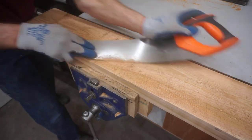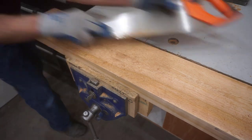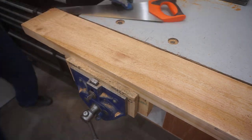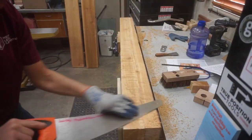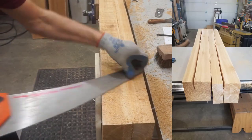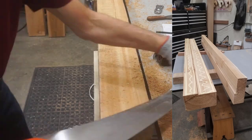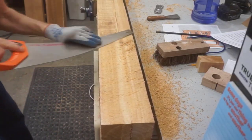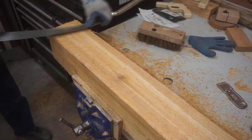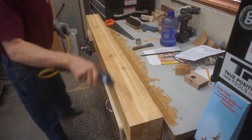And the same technique works great for removing burns and blemishes that the cedar often gets during shipment and handling. With a little bit of time and a dose of elbow grease, it's amazing how well the surface is restored with such a simple process. I used the same technique to retexture faces on a 6x6 post that had a huge crack in one face. After resawing the post and some creative milling, I glued it back together to salvage it for use in the project. You can see here I'm using the same saw with a little different technique to flush up unevenness between re-glued post halves and recreate an even rough sawn texture to the post. Gotta love it when something so simple works so well, right?